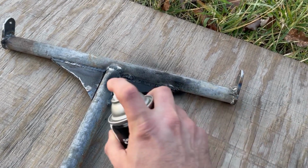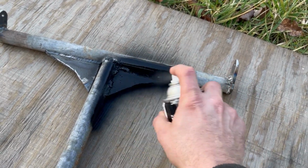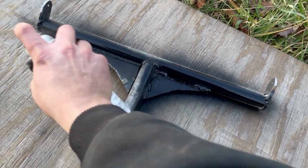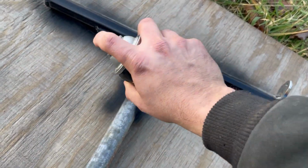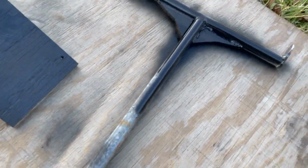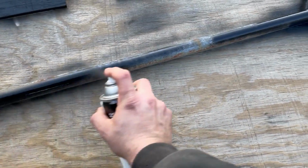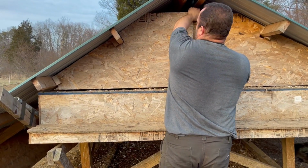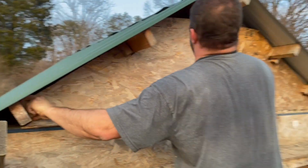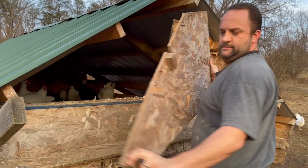I didn't get it on camera, but the next thing I did was weld up the pipes. I had some scrap steel laying around the farm used for the pipe, and some gussets I had from another project. Then I welded up the tabs on the end to mate up with the brackets I'd made earlier. I also welded a nut into the pipe for the pivot, the mounting bolt that would allow the solar panel to pivot for the angle of the sun.